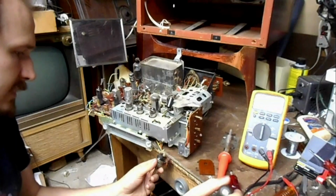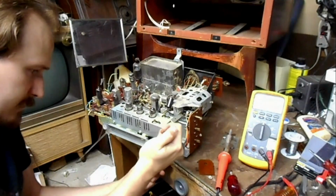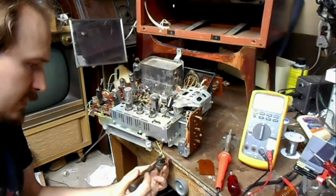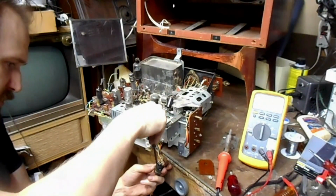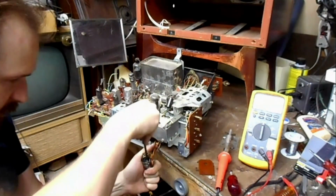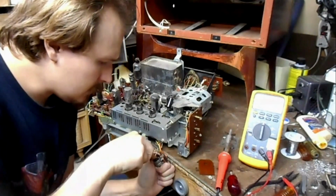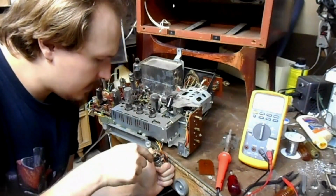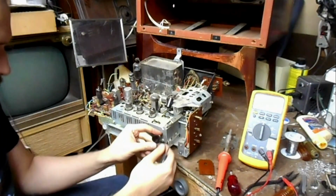Well, I'll still give you a 50-cent tour of how you fix up the power switch. There's 3 fingers around this plastic body on the back here, the plastic body being the switch mechanism. Now you want to use a much finer screwdriver than the one I'm using. Matter of fact, do I have one on the bench? That's Phillips. There we go. Okay, so one finer screwdriver, and we bend the fingers out of the way a little bit so that we can pull this out of here.